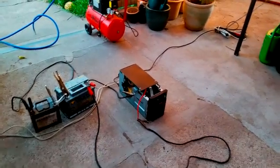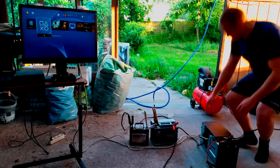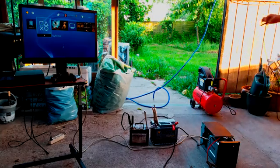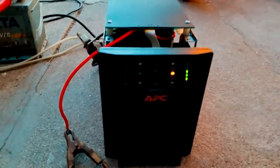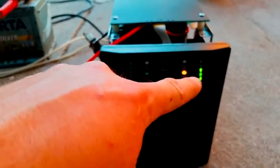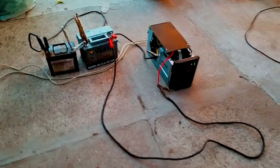The exciting part comes when I'm going to unplug the UPS and hopefully the PS4 stays on. I'll disconnect the power for the UPS. Would you look at that? Power is out. It's beeping to warn us that the main power source just disconnected. At the moment you can see it's using the batteries — there is no power from the power line. The batteries are in use and you have three bars on the battery indicator. So what is powering the PS4 and the screen right now are these two batteries.